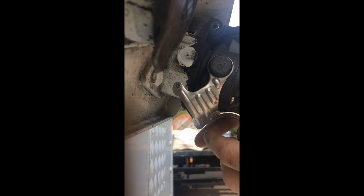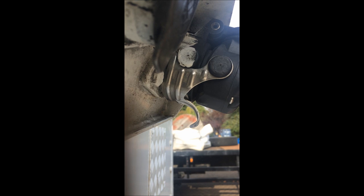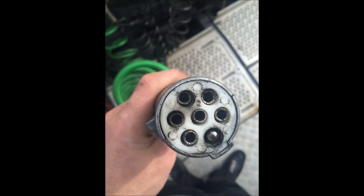Next thing, EBS connector — lift the flap up and locate the EBS connector correctly. We've got that curved locking arm there; we're going to push that round and lock it into place. It's illegal if that's fitted not to use it — it's got to be connected, it's against the law.